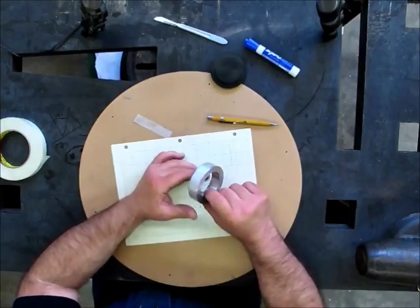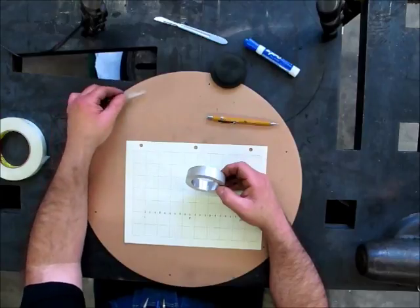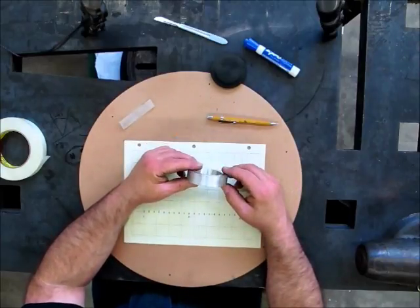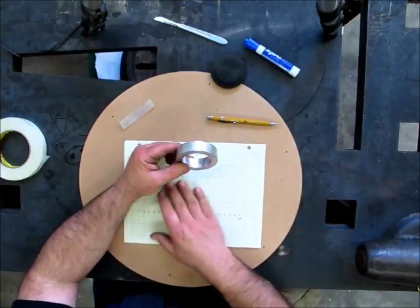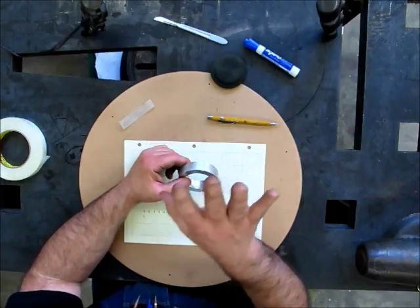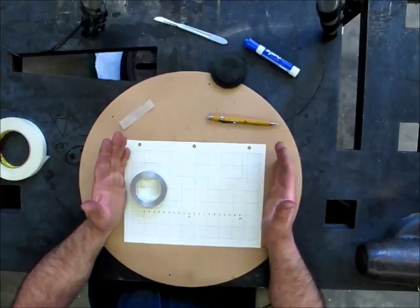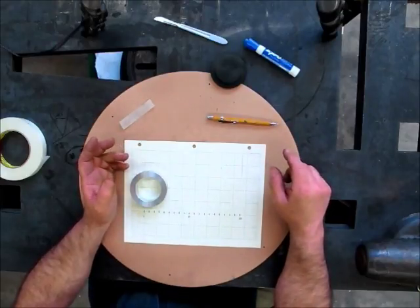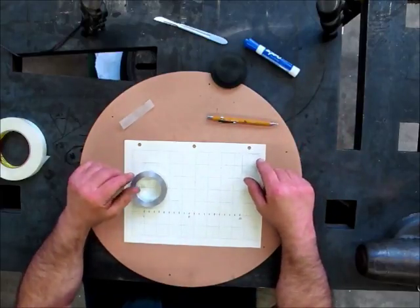Now, I'm not going to use this to drill the holes because I want to show a different method for that, and I don't feel like making another ring. But anyway, there's a way using this kind of graphical layout method that you can divide a periphery up into equal spaces. This also works for plane figures. An example might be spacing the pickets on a fence. So you have a fence of a particular size and it doesn't divide evenly into a number of pickets, or you don't have a tape measure or something like that. You can use this method with string and things like that to help you lay out those pickets on equal spacing. So kind of an old school trick.